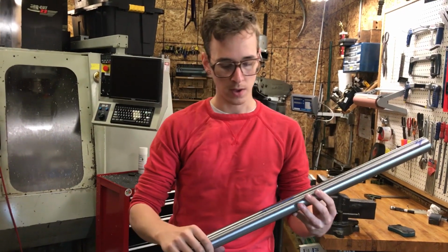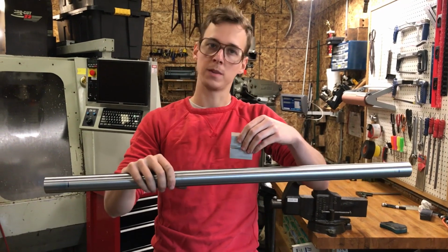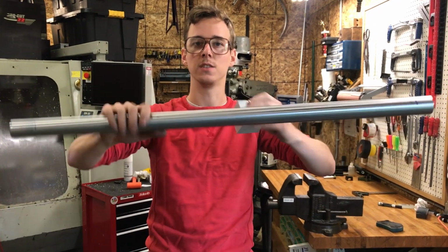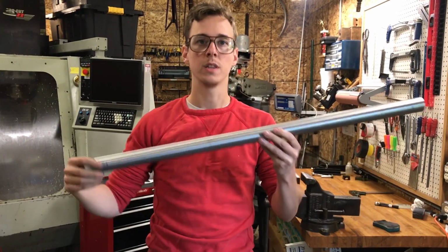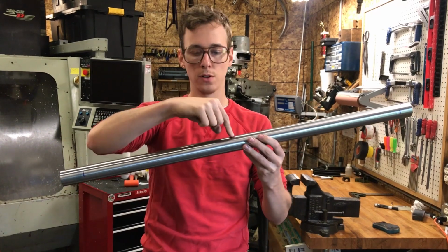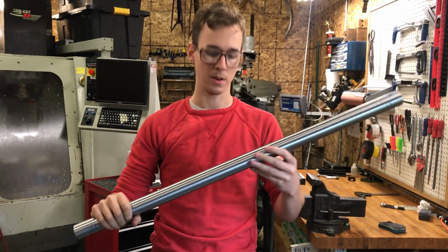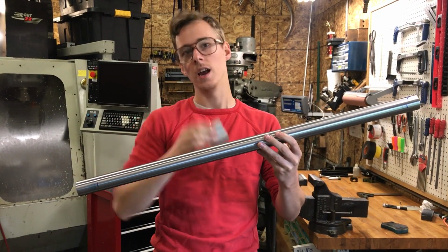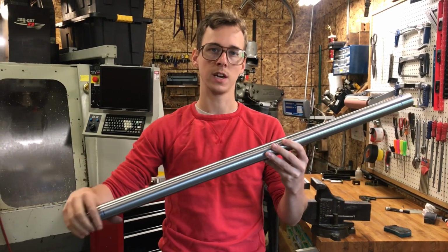And the whole time, I'm gonna be using one of these Paragon Machine Works tube blocks, clamped and locked on here, and that'll keep it easy for me to phase the tube, the clocking of the tube or the phasing of the tube. With that block on there, I'll be able to drill the holes for the water bottle bosses, and I won't need to reorient things or pick stuff up again because this gives me square edges, and so it's really easy to index on 90, 180, 270 degrees off of my starting location.